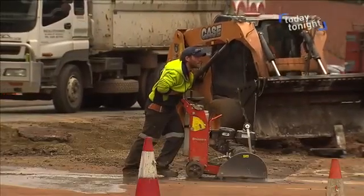He says it's now a matter of educating the public that there is an alternative to bringing in the wreckers to fix a submerged pipe. If you've got a pipe under grass that's 600mm deep, just dig it up — relining's not for you. But if you've got a pipe that's under concrete, behind a wall, under a slab, or in a ceiling space where you don't want to damage finished surfaces, we'll get people to talk to you.